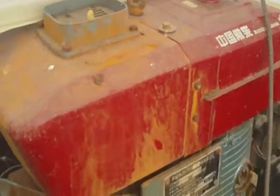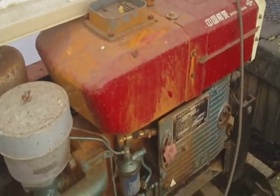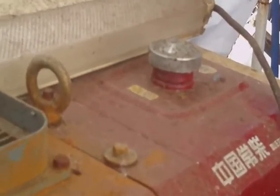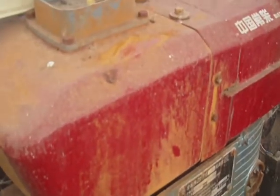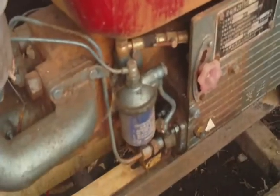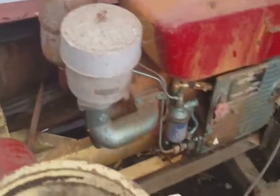Let's go back to the motor for a minute — this is diesel power. The rust on this thing is just because the water here is really rusty, a lot of iron in it. We're going to be going over some videos on how to get the iron out. The way this thing works is you fill this with water and that with diesel. As you fill it up, that little yellow button will raise up, and the water encompasses the head of the motor. As it heats up, it's just evaporation — that's how it stays cool. It'll boil and spit and sputter, and that's why you see all the rust on top. We'll be cleaning this up, cleaning out the air filter, putting on a new oil filter, and going over everything in the near future.